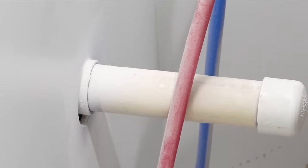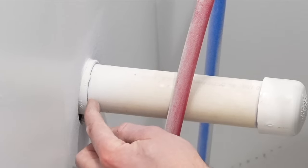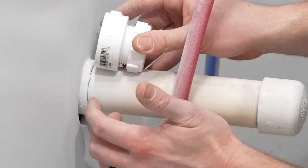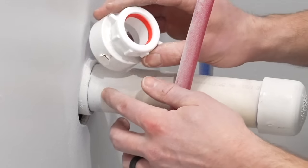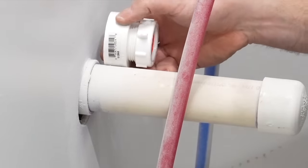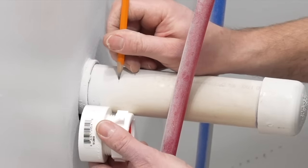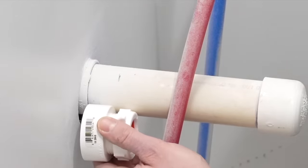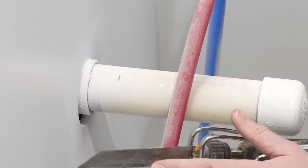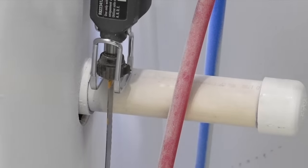When I did this last time I had to put bags over the water lines because I cut them first. What I'm going to do is measure off this collar and come over about an inch in order to attach this Marvel adapter to the drain line. This adapter is an inch and a half to an inch and a quarter slip joint so that my P-trap can go into it. I'll mark the cut distance, then use a reciprocating saw with a metal blade for a finer, relatively square cut.